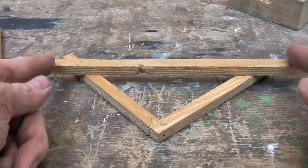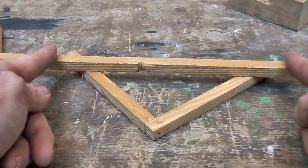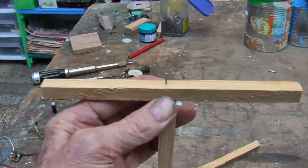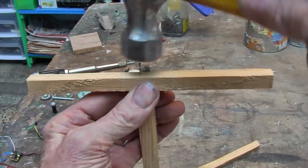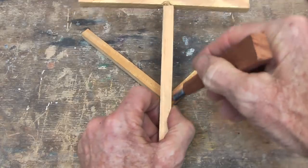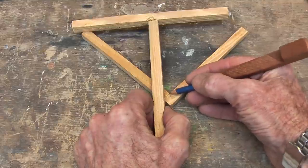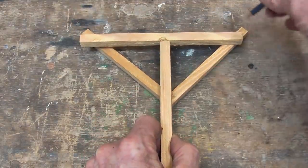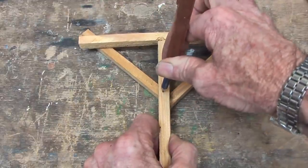Then I will need one that will go across the wide end of that angle. Then nail, glue and screw that as a T, marking it in the center. Now we are going to join those two together. I am going to take this side of my T, this angle here, and align it with the very point of that V, and low enough so that I can nail those across there and put a nail through here, or a screw.